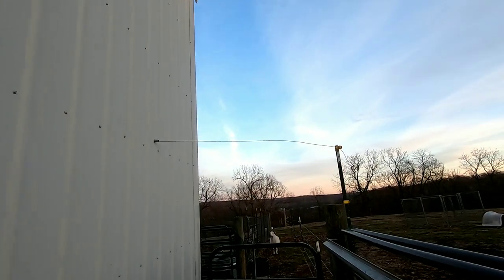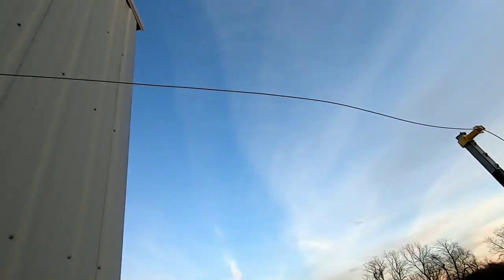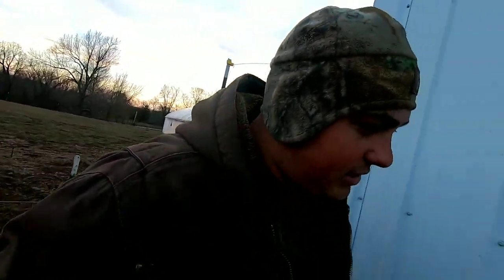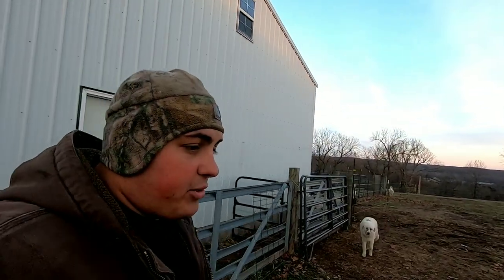Let me show you guys this right here. I'm 6'4" and this is about 8 feet tall, so it's not too bad — it just goes across. That is hot wire, so I don't want to touch it; it gives me and the animals plenty of clearance. So it's not too terribly bad — I'm no professional, but it's not too bad. We've got the controller over there, I've got the hot wire cutting in. That's my idea with the whole PVC pipe — it's protected. Comes into the charger, and then I've got the ground wire going into a dish right here. It works, and it doesn't look too tacky — nobody likes a tacky job.